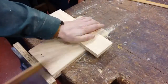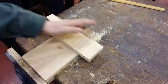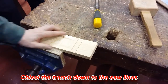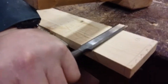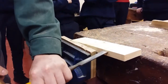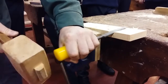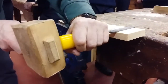I'm checking to see that I don't go down past the line, and once I've hit the line that's where I stop. This is very important because when you go to chisel this, the chisel will want to follow the saw lines — so good saw lines ensures a good clean trench. I'm putting the chisel into the face at a slight angle, taking the chisel out to the edge, standing at 90 degrees to the bench. Using the mallet with the chisel, I take it out to the edge and tilt the chisel at a very steep angle, working my way down towards the line and up towards the middle of the trench.